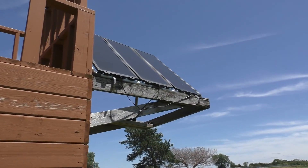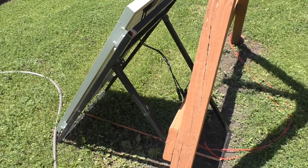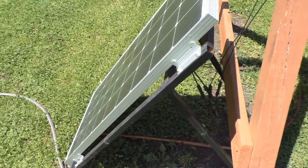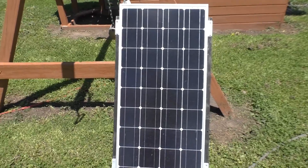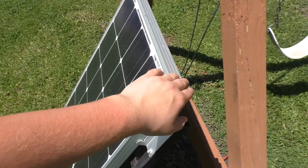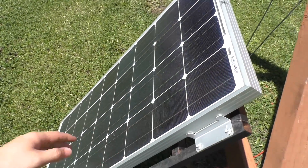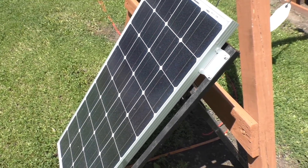So I have a total of 145 watts worth of solar power coming in, going into a total of roughly 300 amp hours worth of batteries, and the 600-ish watt inverter — it's a weird inverter, like 600 watts for five minutes and then it drops to 540 watts after that. But anyway, that's just a quick update on this solar system. I think it's been two years since I put this up; I originally wanted it for power outages, and I've only had one power outage that I've actually used it for since building it. I also took it camping and stuff like that, so it's come in handy a few times, and it's fun to experiment with solar power and see what it can do.